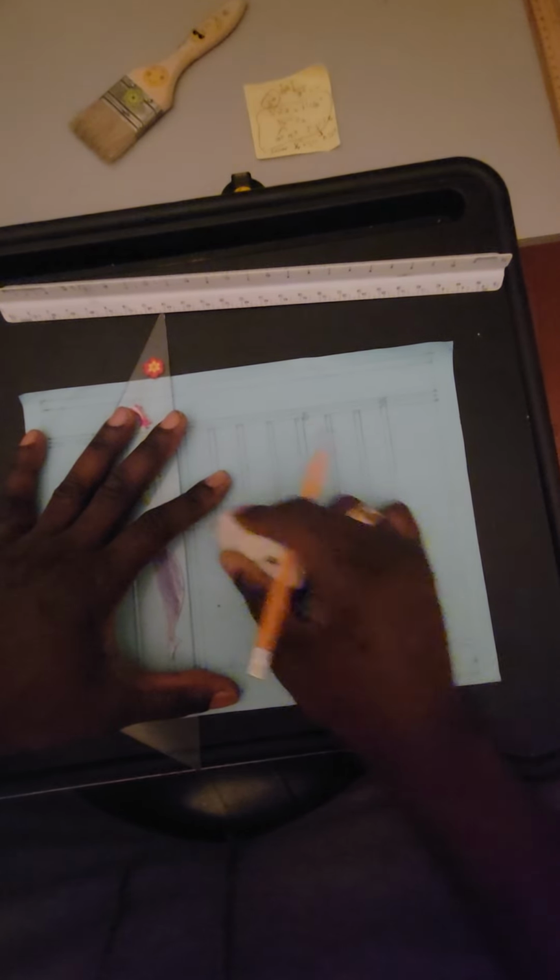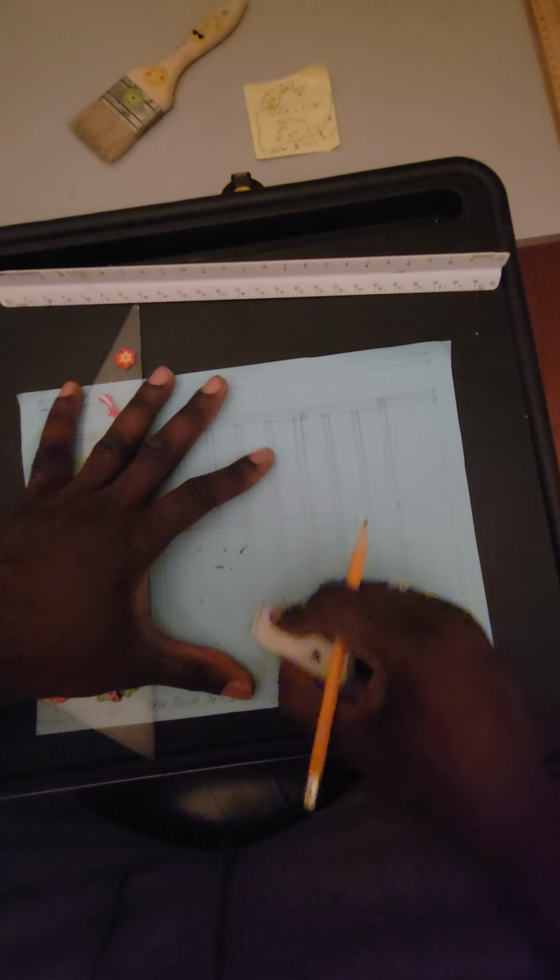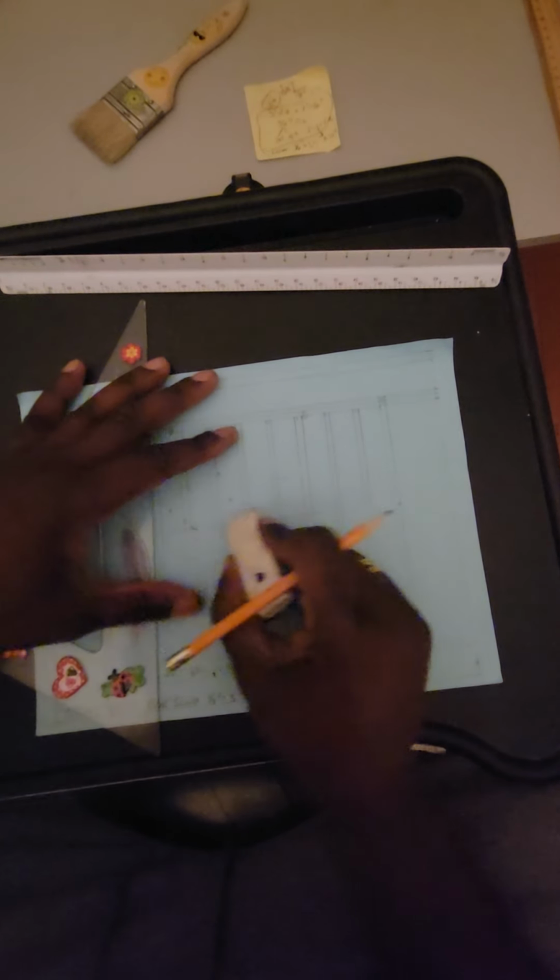Let's get rid of most, we can get rid of all of this in here because none of this pertains to the door. But as you can see, I'm leaving it up top. Ask yourself, why would I leave it up top? The reason why I leave it up top is because it easily becomes a top cripple, a top door cripple.